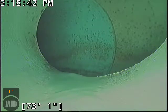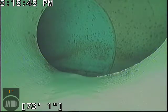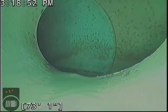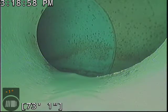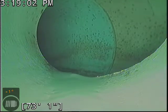Your belly starts somewhere around 50, 55 feet. In theory, if you blocked up there, by the time you've filled up back to the first fixture in the house, that's probably 70 feet or so of pipe. The amount of head pressure you create doing that, with all the water weight sitting on that blockage, would in almost every circumstance push the blockage through. That's, of course, unless you're putting things down the line that shouldn't be going down there.